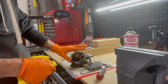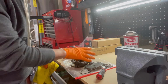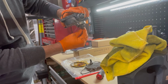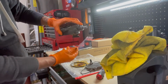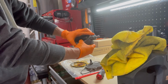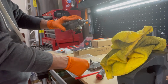Okay, so before we finish setting up the O-ring, we're not going to be putting on the back plate out here. It's going to be put on when we put this into the car, because if we don't align this just right, it's easier to make the adjustment here. I'm able to move it. If I seal this unit, odds are it's going to be quite tough, and I may have to rotate the engine in order to fit it into this hole. So we're going to put this into the car, rotate it here, and then put the back plate over it. But before we do that, I need to put on the new O-ring on the other side, so we're going to clean that up.